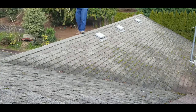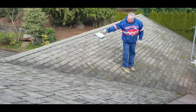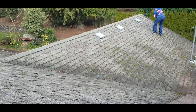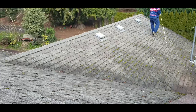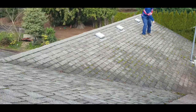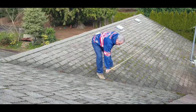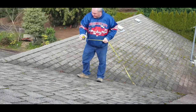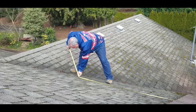You see how this valley comes in right here? We're going to measure halfway up that. So if you measure like right here, the excess here would go down here to square that off — so measure the middle of it. I actually like to go a little bit above. So we're going to measure it: 20 feet by 27. So that side is 14 by 27 — that would include this valley. So up this side of this valley, this side right here, halfway up: 9 feet.